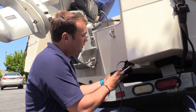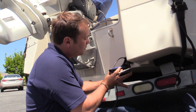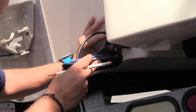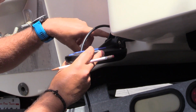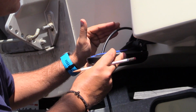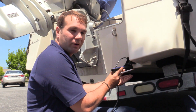If it's at an angle, this will mess up the side scan capability. So we're gonna try to find the perfect spot that's 1/8 of an inch below the hull and parallel to the waterline, or maybe slightly down. Also, check underneath the boat to make sure there's no strakes, other transducers, or any obstruction that can cause turbulence in the water and mess with your transducer. Maybe have a second set of eyes and hands here to help you put pencil marks. This is the most important part of the installation.